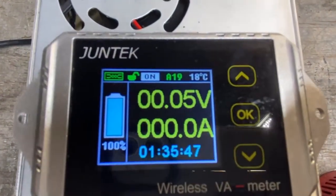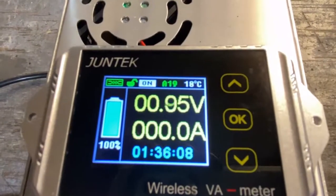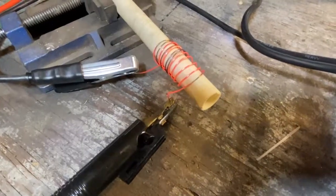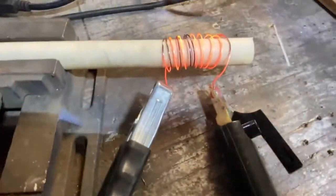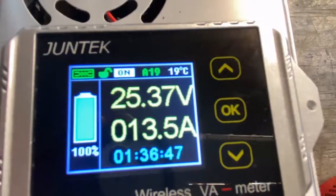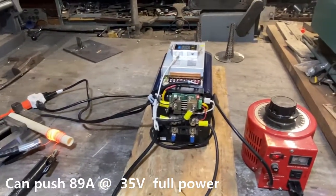That's what this little modular unit is — it reads the voltage and amps. I'm going to crank this thing up. 15 amps. We're at 25 volts, 13 amps. I think this thing is going to make a fine electro-polishing power supply.